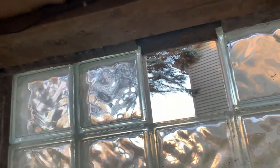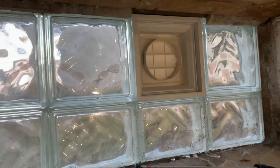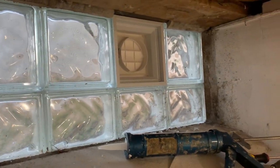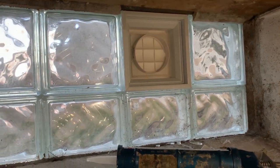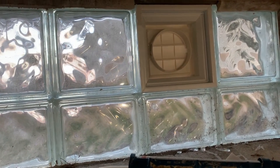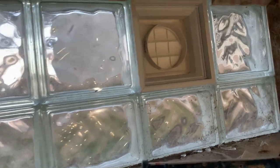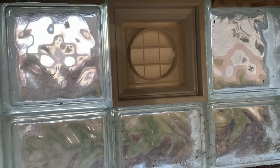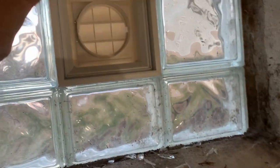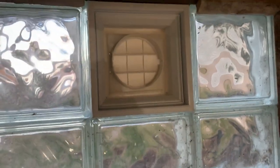I really have to clean up all the excess glue and glass that's still on the sides there so the ventilation will fit in place. I just finished putting in the vent and it slid in really nicely. One thing you have to consider is you really have to make sure you do a good job cleaning up the glue and glass on the sides of the blocks because this is a very tight fit. You want it very clean and it should slide right in. I applied some silicone to the outer edges and we're just going to let that dry up, then clean up the edges and add more silicone around them.